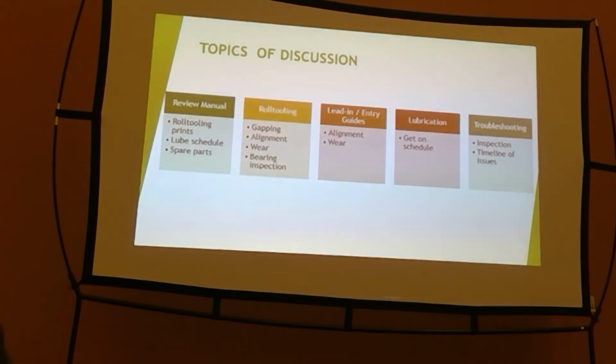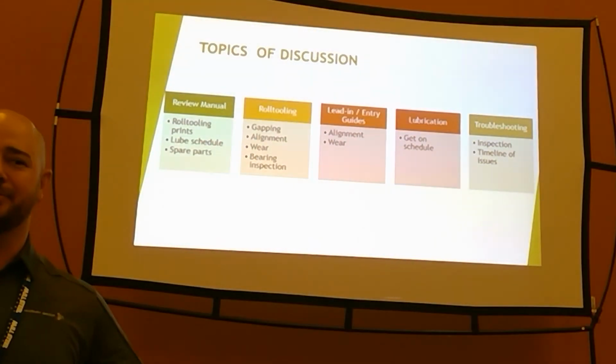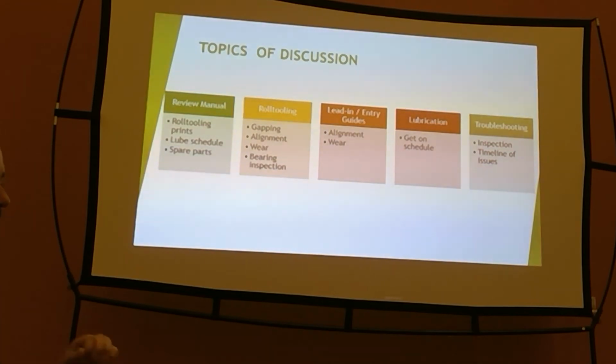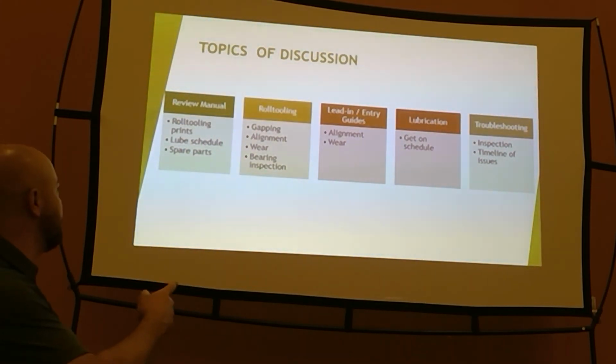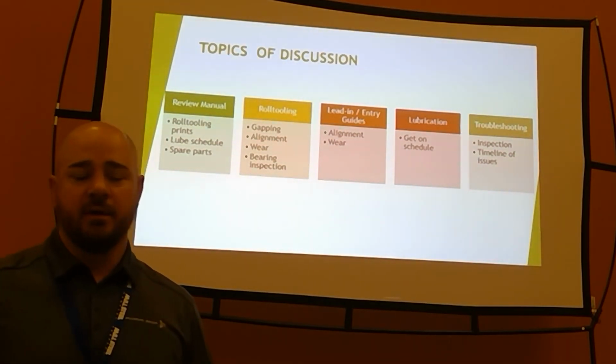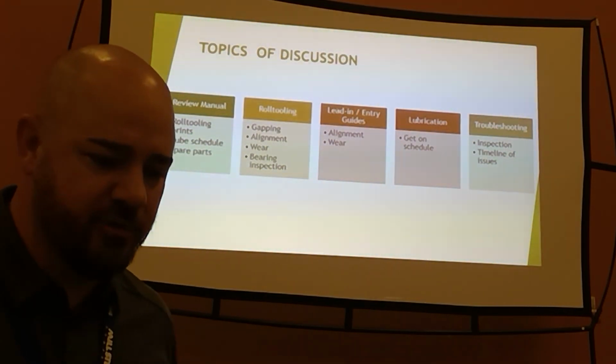I'm big on alignment. When I get to somebody's facility, I'm going to go over their alignment, whether they think it's right or not. It's so huge. It's paramount. Alignment is king. It really is, in so many things in the roll forming world. Checking out your lead-in wear. Obviously, like we talked about, your lubrication schedule: either make a schedule, or if you have a schedule, you stick to it. Whatever it takes, be preventative. Do the right thing for your machine. And then I get into a little bit of troubleshooting. That's kind of my passion. So taking care of that equipment, trying to get you a good product is kind of where I live.